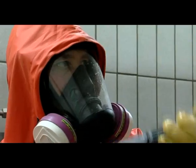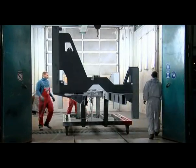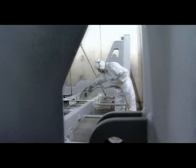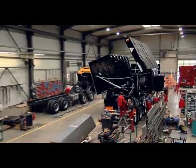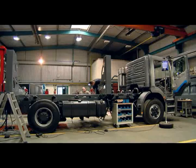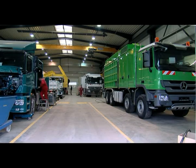The metal surfaces are degreased in a modern phosphate coating unit. Then painting takes place using two-pack paint in the colour requested by the customer. The suction units are completely assembled in the final assembly area and are tested. The strict separation of working areas with a great deal of dirt and the clean final assembly areas forms the basis for our high quality.